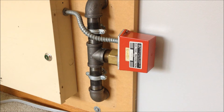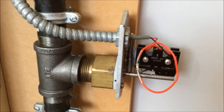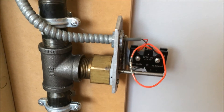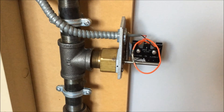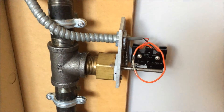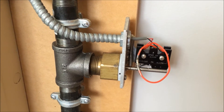To change things up a bit today, I'm not going to be pulling anything. Instead, I'm going to set off the system using the water flow switch on the fire riser. With the cover removed from the water flow switch, I'm able to access the lever that connects to the vane inside of the pipe. On the zone on the DMP panel, I have this set up for a pre-signal retard — all that means is that a short activation won't set off the system in case there was a change in water pressure or such. But when there's a prolonged activation of the vane, it'll first sound a pre-signal alarm, and then 10 seconds later it will go into full alarm. The DMP system will activate, and the main fire alarm system will activate. So here we go.